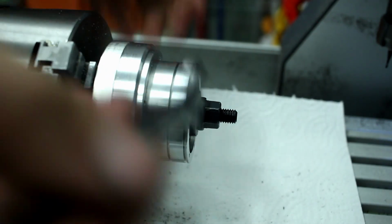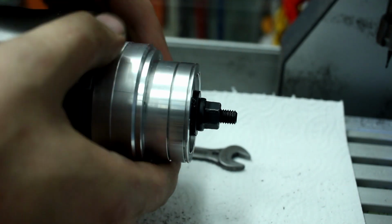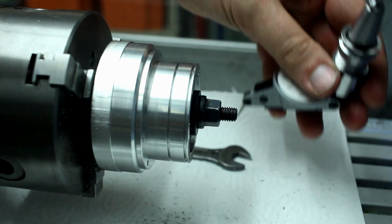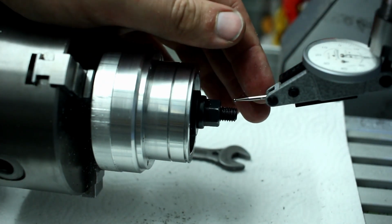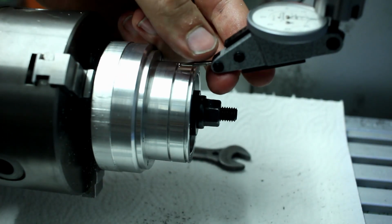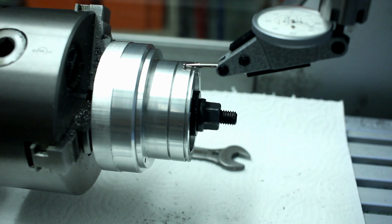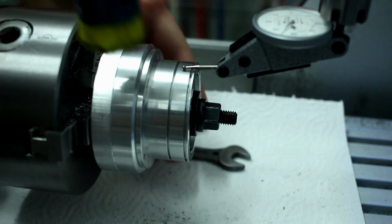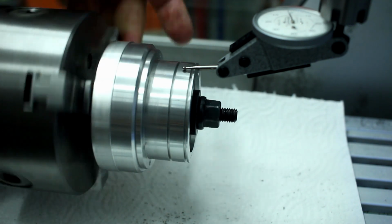Now we will tighten this screw a little bit, this nut, and now I'm still able to shift this part around until it runs true, and for that we need an indicator. In this case, I'm just dropping a dial test indicator into the spindle of the mill. Then I look for the high spot, and do my usual indexing. Okay, that's well within 10 micron.